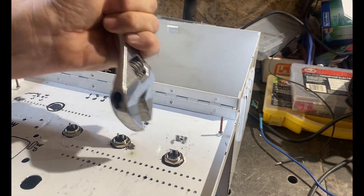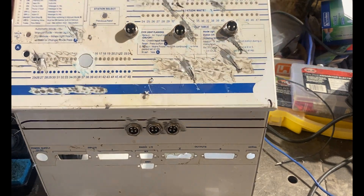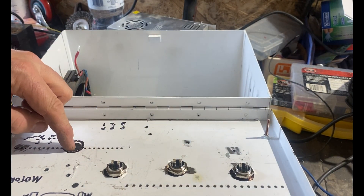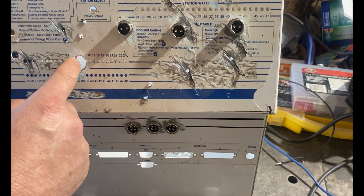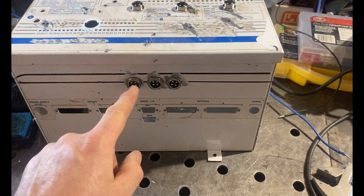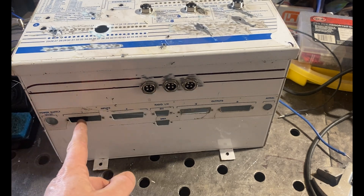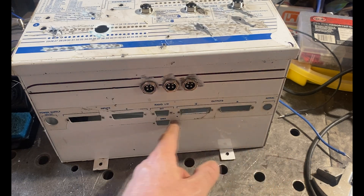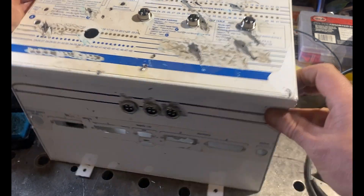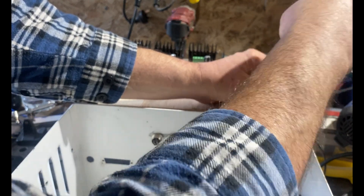I could use a socket instead of the shifting spanner, but the spanner was there to be used. That's what the top will look like when the box is closed — motor wires come in through the headers up to the IBT2s sitting just above. A USB cable will come through here with a rubber grommet so it doesn't chafe on the sharp sheet metal. The hall sensor pot headers are in the side, I'll run the 240V leads through and zip-tie them. A fan draws air through from the other side.